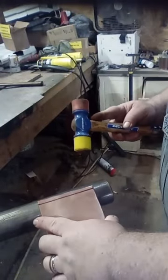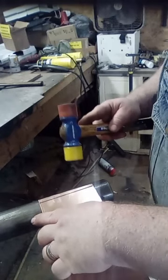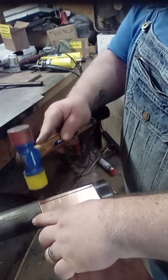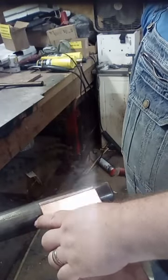First thing is the sidewall. That black line is where you're actually folding everything to - this will be the main body of your cup. So this piece, we're trying to just straighten the edge. I'm using the hard end of a rubber hammer on top of a piece of two-inch pipe. All I'm doing is hammering that very edge to straighten it just a little bit and add a little bit of curvature to it.